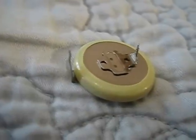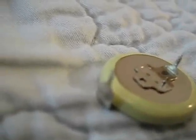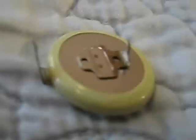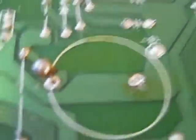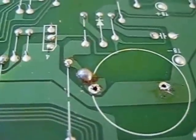Another really important thing: you want to make sure that you put the battery in the same way it was before. Make sure you keep an eye on exactly where those pins were when you're taking the battery out, so you don't put it in the reverse position. You want positive and negative exactly the same way they were in the circuit board, and you're going to put it back exactly the same way — make yourself a little picture or write it down. Here's our battery that we took out of the keyboard: it's a 2032 with solder leads attached. There are your two soldering points right there — that's where you're going to re-solder it.